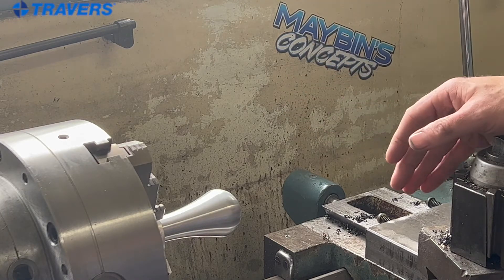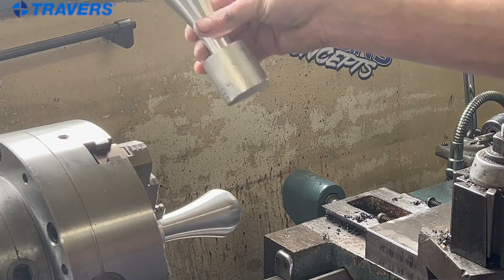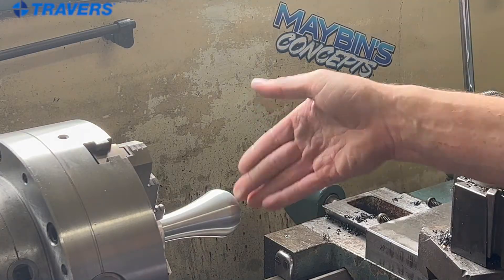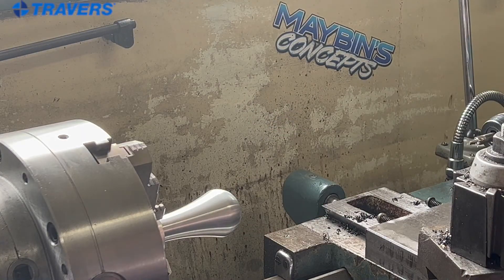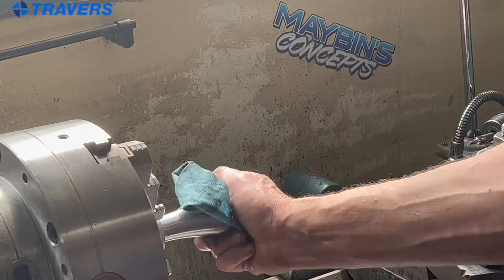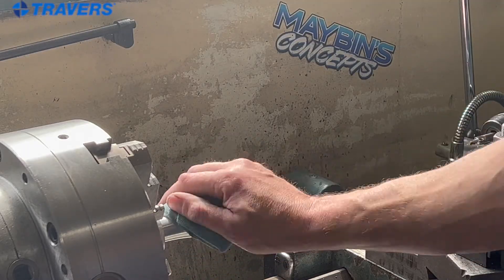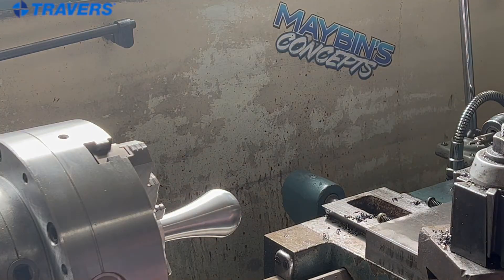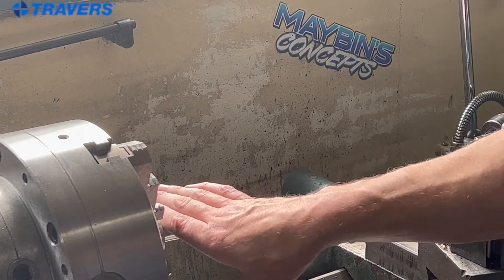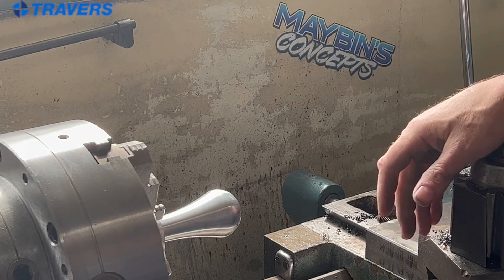Other than that, it's a great trick to turn a rough part right off of CNC into a smooth part in just a few minutes' work. I like to run the machine at a faster RPM — the sandpaper and the Scotch-Brite seem to grab a lot less faster than slower, so that's why I was running 765 RPM there. That tends to drag less, therefore it catches less. So that's it, that's that one.